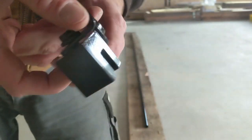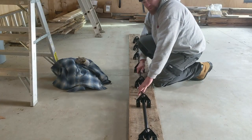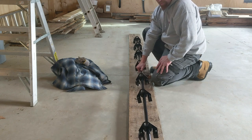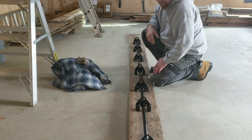Here are the blocks — these go on the seams, they sit on the roof like so. These Allen key bolts pinch the seam. We're getting all of our pieces ready. We basically just preload the pipe with our blocks, which allows us to bring the whole assembly up there and affix it to the seam. It lines everything up real nice, and then we can feed the second layer bar through after.